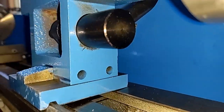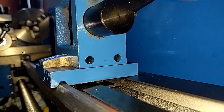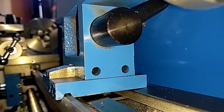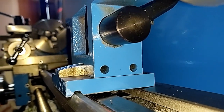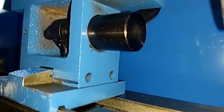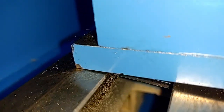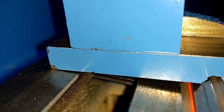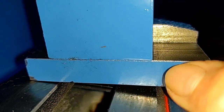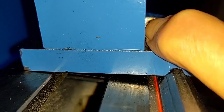I've seen other people talking about the same problem. You can see it's on both sides, it's on a slant. The V is not cut correctly. And I believe if you cut the V full depth, you're then going to have to shim the head portion, because by that time that gap right down there underneath will drop this side substantially, and then this will be too short.